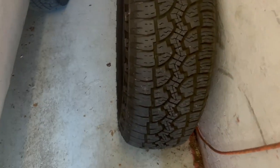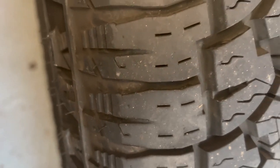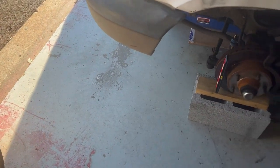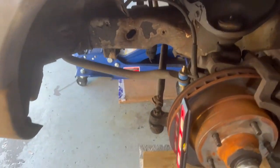2002 Dodge Ram Van — I go through tires like nothing. That's the outer, that's the inner. You see how thin? These tires are like two months old. I've had three alignments done over the past five years for nothing. They take your money and they can't handle it. So apparently I have a camber problem.